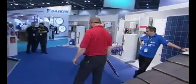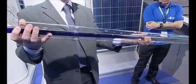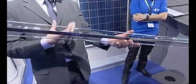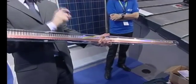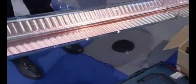Just to explain what this tube is — it appears as though we've got a unit which is not insulated, but in fact it's completely the opposite. We're using a vacuum, which is the most natural and best type of insulation you can have. We've got this little fin, this absorber plate, which absorbs irradiation from the sun and converts it into heat energy. It heats a pipe on the back with a very small volume of liquid which boils at only 30 degrees. At 30 degrees that liquid turns to a vapour, rises up inside the pipe, and heats a condenser at the top.